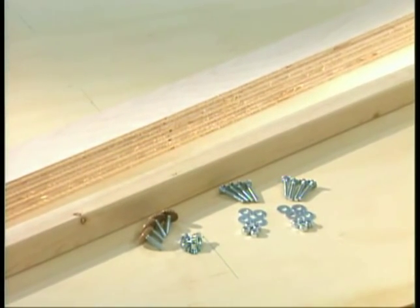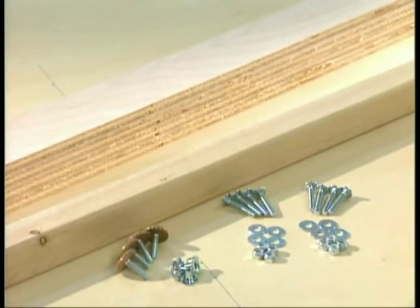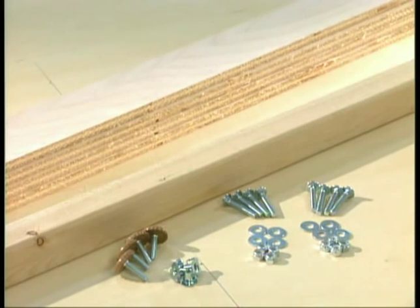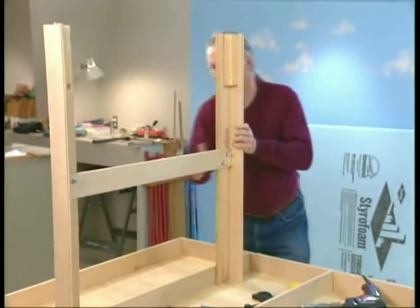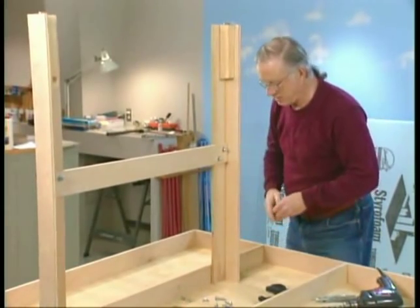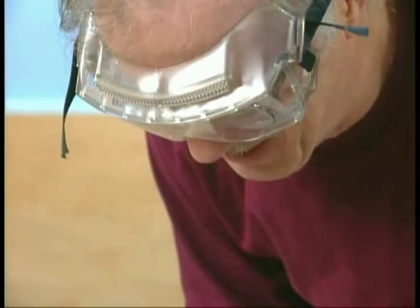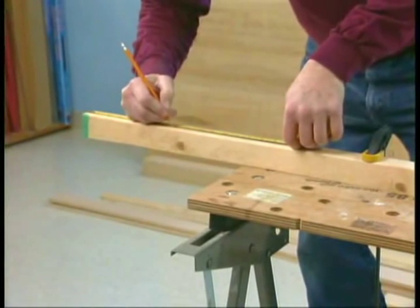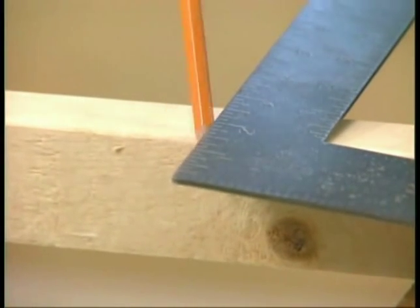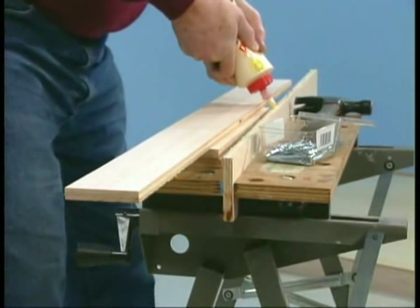On to the legs. You'll need an 8-foot 2x2, 8 of our 3-inch plywood strips, 4 T-nuts and threaded leveling feet, 8 quarter-by-2-inch carriage bolts, and 8 matching quarter-inch washers and lock nuts. We'll end up with two interchangeable H-shaped legs that are connected to the frame with nuts and bolts — this makes it a whole lot easier to move your layout and reassemble it. Cut 8 of your plywood strips to 40 inches; that'll be the height of your table. You may want to make it slightly shorter if you have children who won't want to miss a clear view of that locomotive chugging down the line. While you're at it, cut four 8-inch lengths of the 2x2 — these will hold the T-nuts and leveling feet at the bottom of our legs. Glue and nail the legs into L shapes and let them dry.